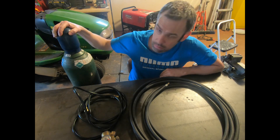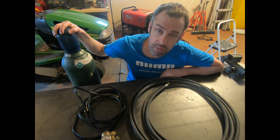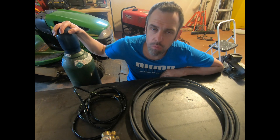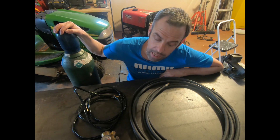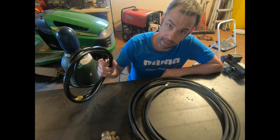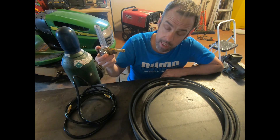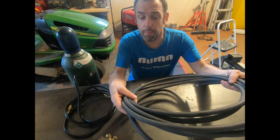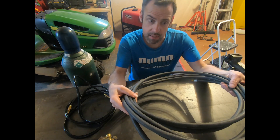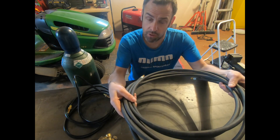So what else do we need? We need a bottle of gas — that's straight argon. You could also use helium, but helium is quite expensive. Argon is great and it's the most affordable of the inert gases. We need a gas line to come out of our regulator, and a regulator or flow meter. This is the torch whip. Inside there is current-carrying cable and also a path for our inert gas to go to the torch.